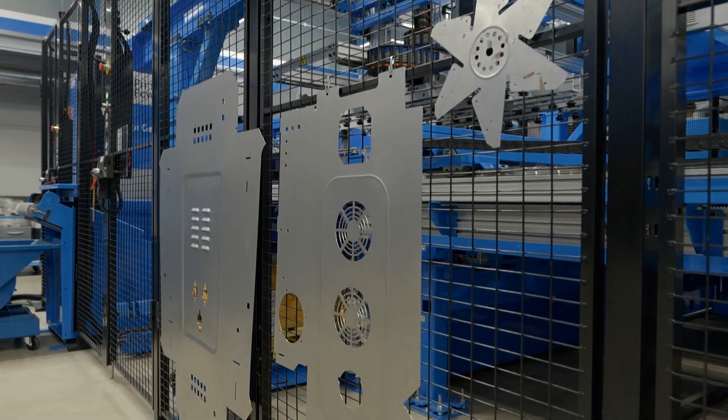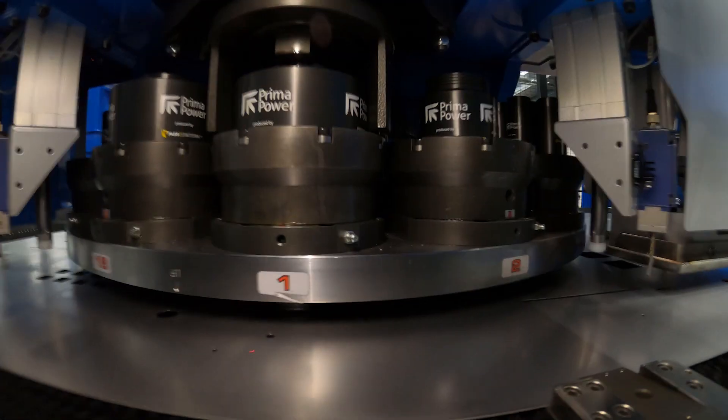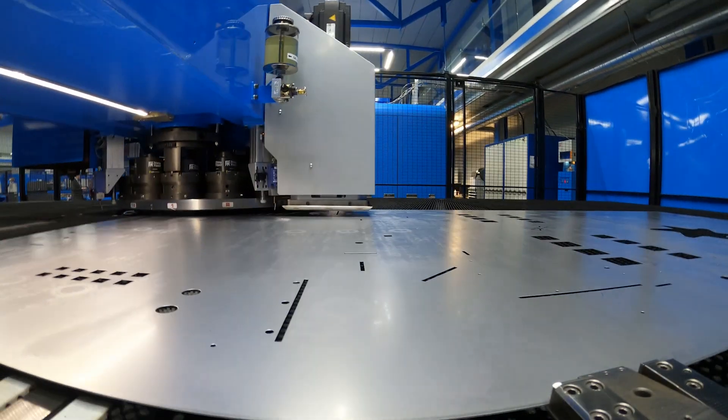With a normal punching machine you can do small holes, big holes, notches, cutouts, forms, louvre panels, tapped forms, dimples — all completely possible. Any of our turret punches can do that. This is the Genius machine: 1,000 hits per minute, a 20-station or 16-station turret with multi-tools, with all of the indexable forming technologies, fully servo-electric.